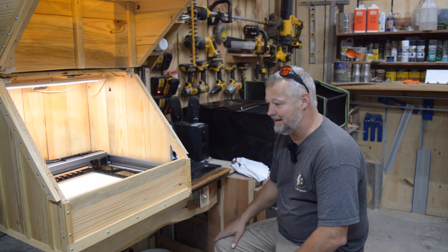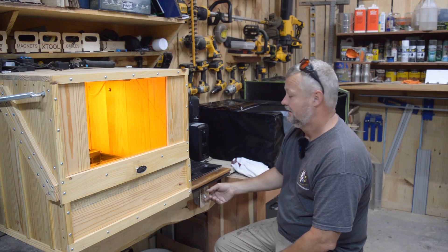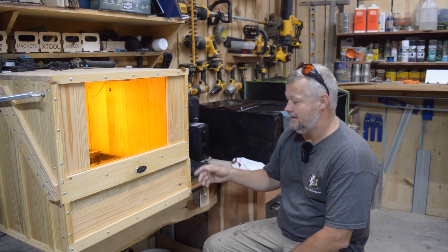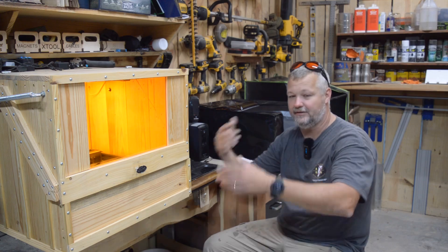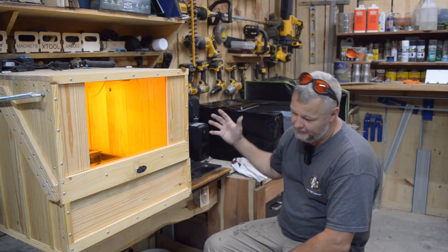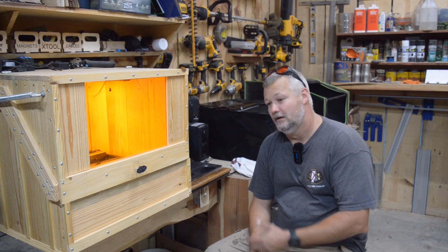I also need to come up with a bigger fan system, because if I'm going to have two machines piped into my vacuum, I'm going to need something more substantial. The 20 watt is cranking out serious smoke. As long as I keep the enclosure door shut and let the airflow do what it's supposed to, I'm not having issues. But with the door open I got a crosswind and it was pulling smoke out. With the 20 watt I definitely have to keep the door shut.